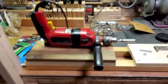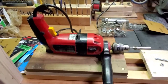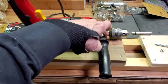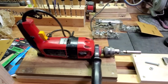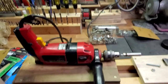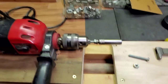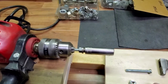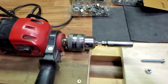Since I didn't have a lathe, I put this contraption together. I had an old drill — about 35 years old, a two-speed hammer drill — and I installed it on a little frame using a bolt through the handle bracket down through some boards. I mounted it so I could eventually extend it and turn it into a mini lathe, but in the meantime I needed something to turn this piece. I basically took the handle itself, put a bolt through it with a nut, and set it up to create a little mandrel to hold the piece so I could turn it.